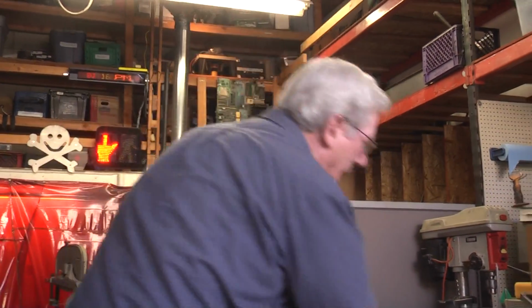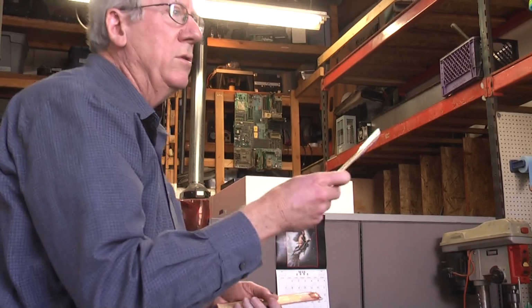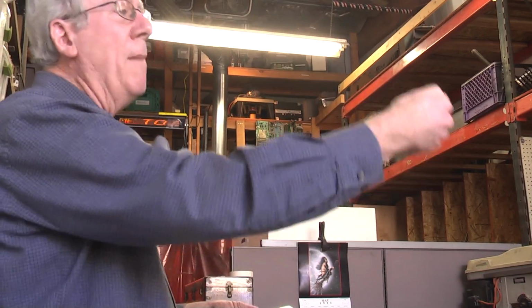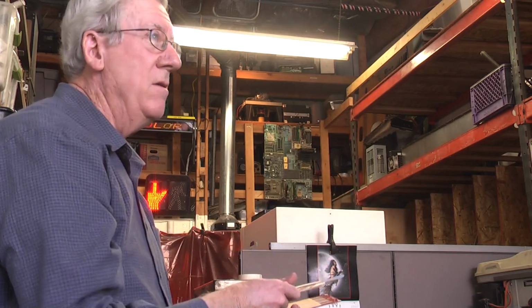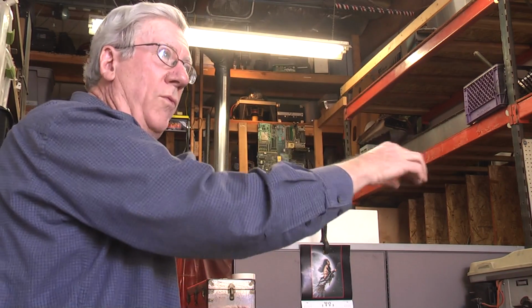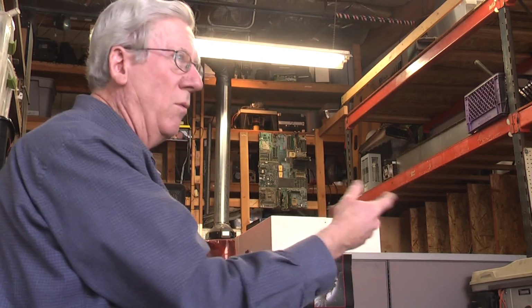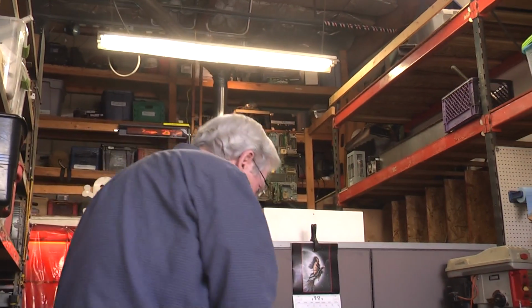Then after you've got your circuit to work, you transfer it to the solder version that's the exact same pattern as the solderless version. It's very important when you use these prototyping tools that you have enough parts to copy from the working prototype to the solder version. Never move the parts, because when you move them, you lose track of where the part came from. You have the additional advantage that when you have one working unit and the solder one doesn't work, you can go back and forth to see where you made your mistake.